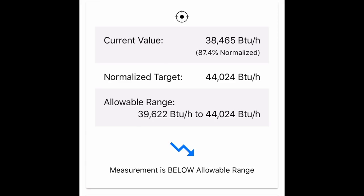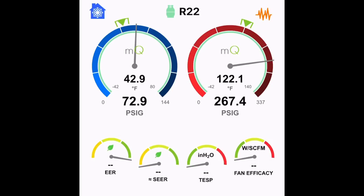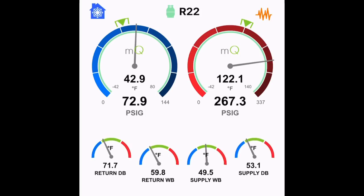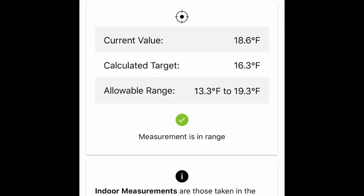You can put them in the unit up on the roof and at least know that at the package unit, you have the correct static pressure. I didn't do that on this. I don't have those probes. I do have a manometer on the truck, but I didn't break it out. Everything else we checked, and it checked out fine.